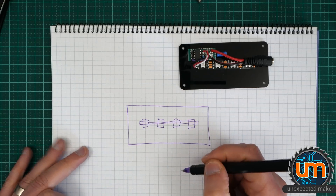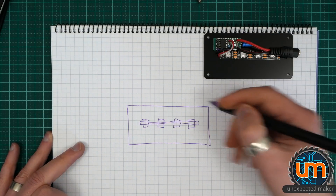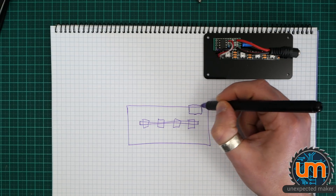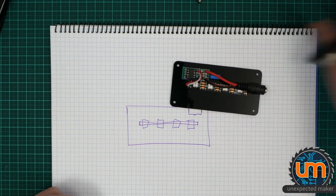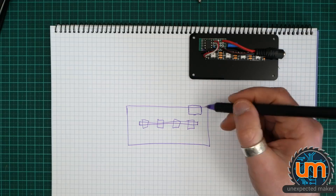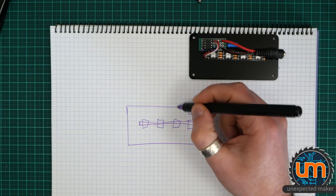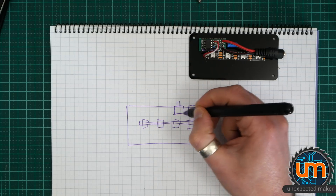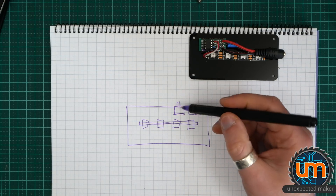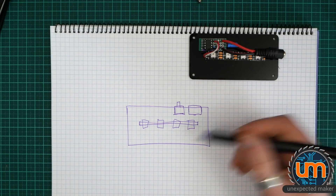We need to have a USB port either on the side or maybe at the back. I'm putting it on the right-hand side just because of where my kids have them in the house and the power comes in from that side. We also want a button to be able to control it, and we don't want the button visible — maybe we'll put it behind. Maybe one of my right-angle buttons that I use in my Reflow Master, sticking out of the back of the case. We'll also need an LDR somewhere, sitting away from the lights and facing away from them, so we can pick up ambient light — maybe with a hole on the side of the case.